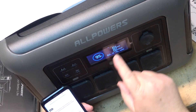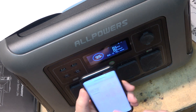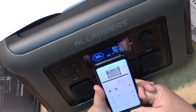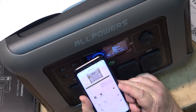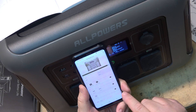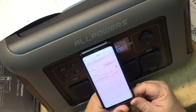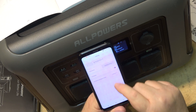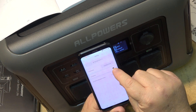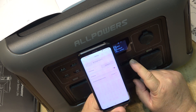I've loaded the app. I press and hold the power button to enable Bluetooth, and it finds my power station. It tells me I'm at 95%. From here I can turn outputs on and off, switch between 50 and 60 Hz, toggle the AC outlet, USB, and DC 12-volt outputs. I can also set shutdown times in eco mode from 1 to 6 hours. The modes are standard, mute, and fast — fast mode charges at the full 1500 watts. I'll put the link in the description. Thanks for watching.